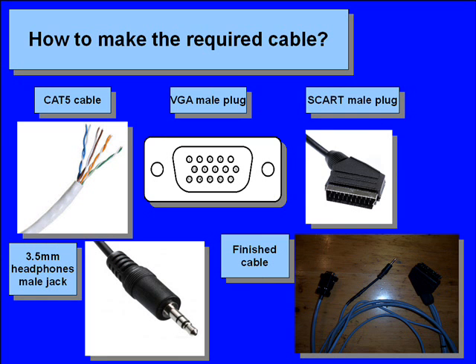How to make the required cable. To make a VGA to TV cable you will need a male VGA plug, a male standard 3.5mm audio jack, a SCART male plug if you have a European TV or BNC connectors if you live in the US, and a CAT 5 cable. Also you will need a soldering gun and soft solder with flux. I warn you, soldering the VGA pins will be a real pain so don't lose your head — be patient and you will make yourself a good quality cable. For the corresponding plug pinouts, check out pinout.ru which is linked in the description below this video.